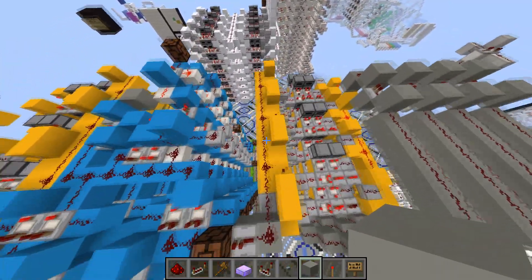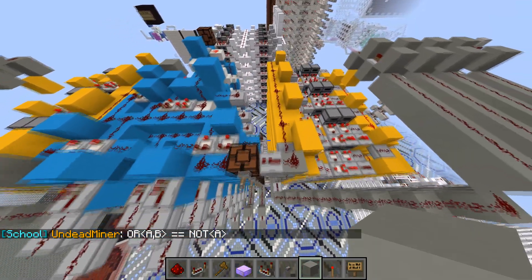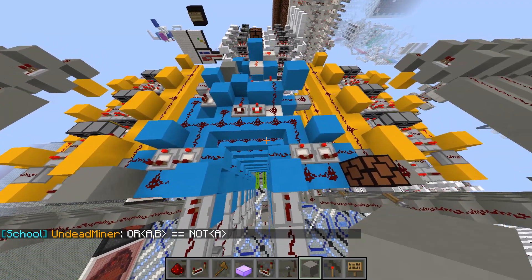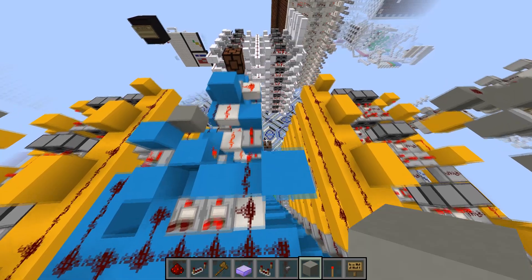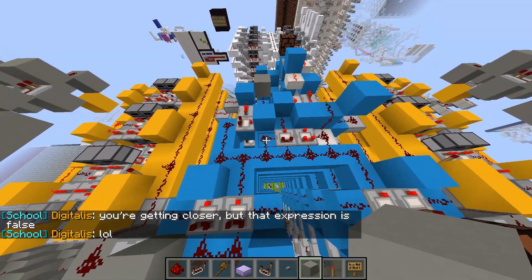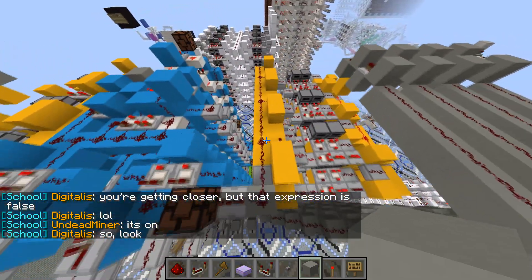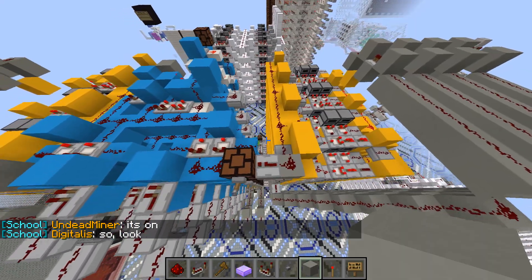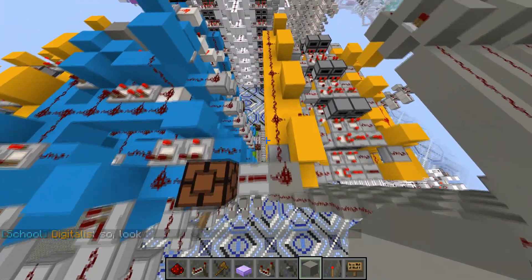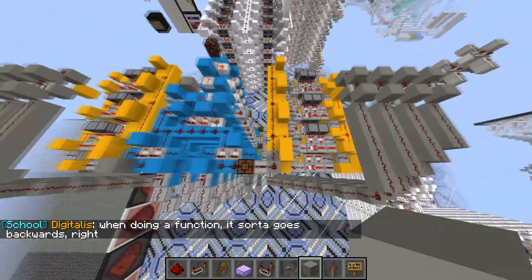My logic here is the write cycle is on some delay — we time the write to be at the pulse at the moment we want it, so that we don't get a continuous loop reading it. For example, if we do register three equals register three plus one, we don't want it to stay open so long that it does plus one twice. Because the write pulse comes at a specific time later on, we can afford some delay there. Meanwhile, the read pulse we want to get as quick as possible.